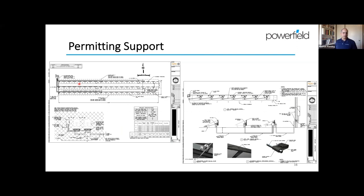This is an example of how a ballast weight diagram looks — cut from a recent permitting package. This particular array was two long rows and one stub row. The different colors and the key along the bottom illustrate that the calculator will vary the weight accordingly — there's almost always more weight required along the outer edges, topmost row, and at the corners, and you can get away with less weight on the interior modules and downwind rows. We can provide additional permitting support and engineering. We've worked with a firm called Aztec that knows our product really well and can turn these around relatively quickly. We've never been turned down from permitting — we've been approved everywhere we've ever applied.